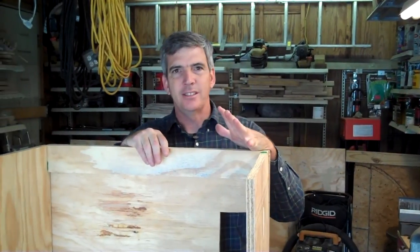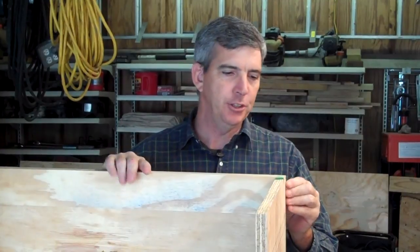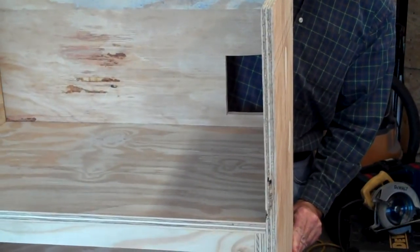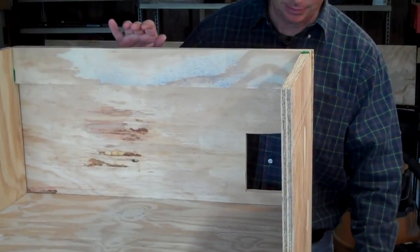This is one of the most important steps of building any kind of cabinet, and that's squaring it up. You square a cabinet up by the back — make sure your panel's square, then bring the edges up and around so that it squares. That's the quickest, easiest way to square something like this.